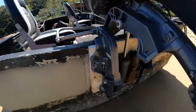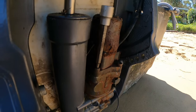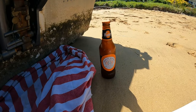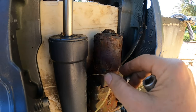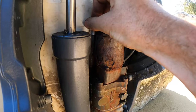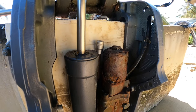Here it is looking very rusty and nasty. My tool of choice for these jobs are these allen keys that go onto the ratchet — quite long. The other tool you're going to need is a coupler. The tricky ones are these back ones; you really need a bit of length on the allen key, and a regular allen key probably isn't going to give you the torque you need to get these undone. So let's start with the tricky back ones.